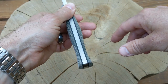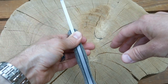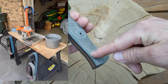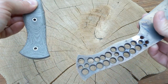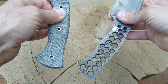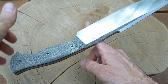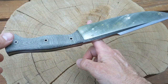I did not taper the tang — I haven't tried that yet. I have a really small 2x42 grinder and it's kind of janky, so I haven't tried it. But I did drill out the inside and remove a lot of material from the handle to reduce the weight before putting the scales on, so it has a similar effect. The balance is really good.